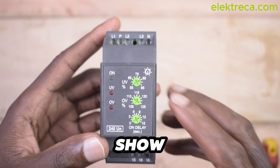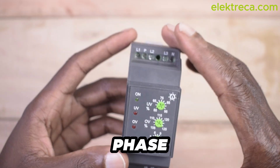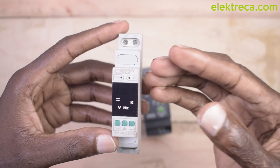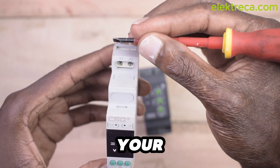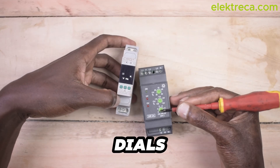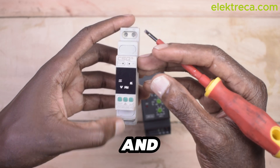In the next video I'll show you how to incorporate this device into your circuit to protect both three-phase and single-phase loads. Alternatively, you may have this — this is also a phase failure relay, but this one is purely single phase. You feed your L and your neutral, and it will start monitoring. You set it the same way, using analog dials for thresholds and timing. This one is digital, so you're able to set the counter, the under voltage and over voltage thresholds, and also the hysteresis.